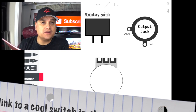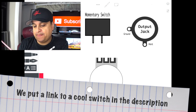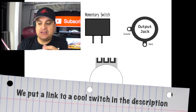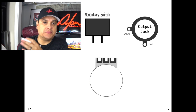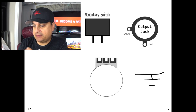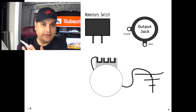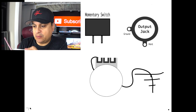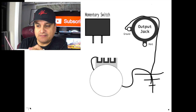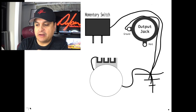Let's go ahead and draw our circuit for this kill switch situation — we'll go to our screen here and do this together. We've got our volume pot, our momentary switch, and our output jack. First of all, we need to have a ground for everything to ground to, so let's ground our volume pot and bend our little volume tab over like that — that's how that normally works. Then we'll go ahead and ground our output jack, and we'll also ground the case of the switch that we're about to install. So everything is grounded.